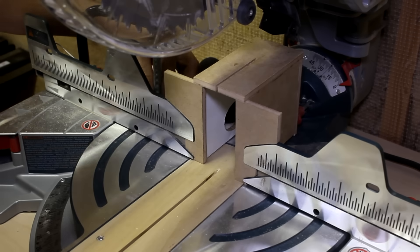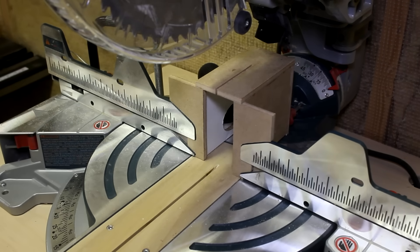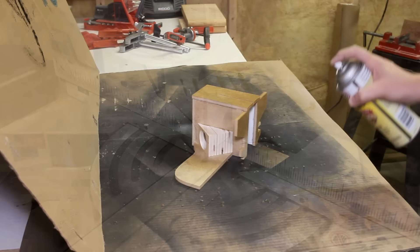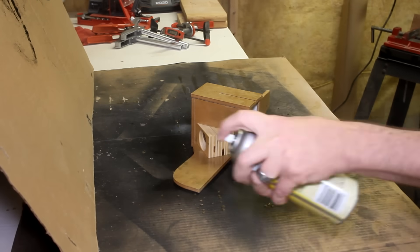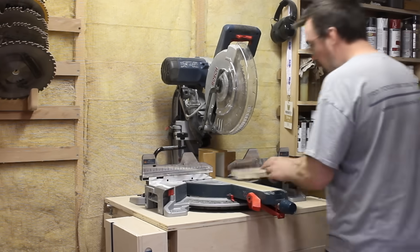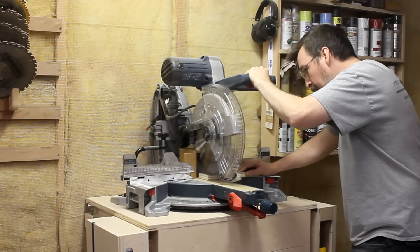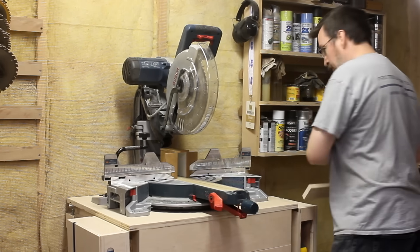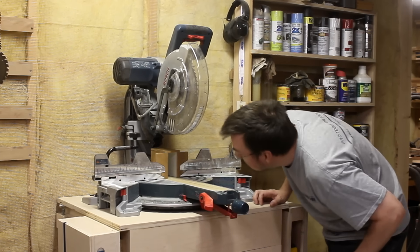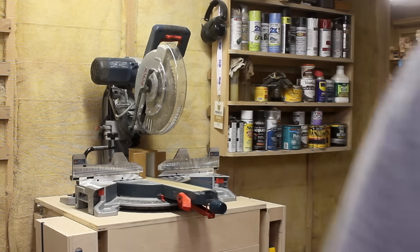Now I know some of you are wondering, can you cut miters with that thing? And the answer is, you wouldn't want to — you'd pretty much destroy it. But the overwhelming majority of cuts I do with the miter saw are straight 90-degree chops, so for that this is perfect. And for the miters and bevels, I'll simply set the shroud off to the side and revert back to the extended dust boot solution, which was still 92% effective. I'm pretty stoked at how well this worked. Every miter saw is just a bit different, so if you wanted to make this for your saw you'll have to piece it together on the fly as I did. There really isn't one set of plans that will work for all of them. But overall, this has been a pretty awesome upgrade to my saw. An 8% increase in dust collection effectiveness might not seem like a lot, but it sure adds up the more cuts that you make. Hey, thanks for watching, and we'll see you next time.